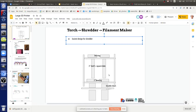And if the blades are spaced to within say 1/8 of an inch, in theory you can't have anything more than half inch wide, half inch long by 1/8 inch. But plastic will deform. If you have the blades spaced pretty closely, you can't just send through huge chunks. What happens is that you keep scraping, and the things that come through have to be pretty small, depending on your blade spacing. It's as simple as that.